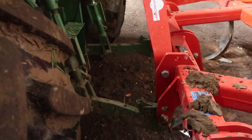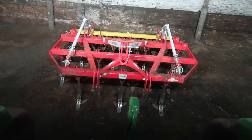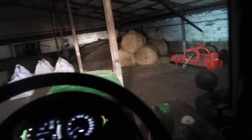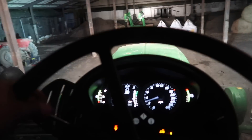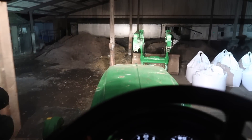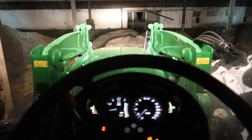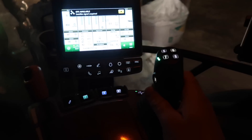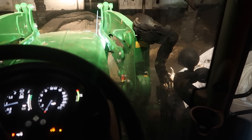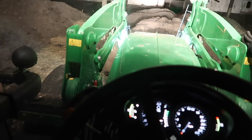Off the arms go — might have to drive her forward a bit. There we go, just have to drive her forward to get the arms to come down. Certainly shined up the blades. Now it's time to go and pick up the front loader. Drive in like that, make sure both sides are equal, then turn the tractor off, put the ignition on, release the pressure — turn back on. Then all we've got to do is use a joystick to just rotate the bucket a bit to get the brackets in position, and then they'll just click in — and there we go, they're both clicked in.